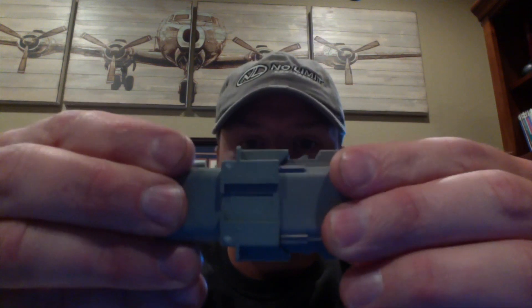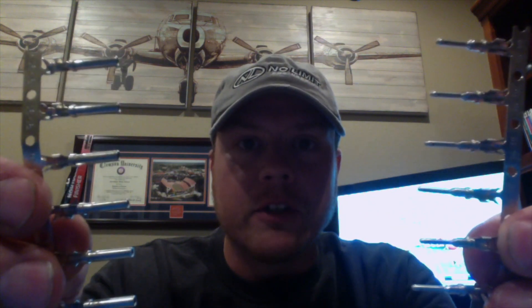What I've got is a Deutsch style connector right here, just to show you an example. You basically have two pieces of it — you've got a male and a female, but in technical terms this is a plug and this is a receptacle, or sometimes also called a socket. They plug together like that. Inside of these you've got pins and sockets and they're opposite of what you'd expect. The pins actually go in the receptacle or the female side, and the sockets go in the male side.